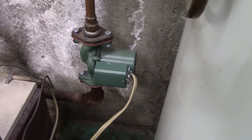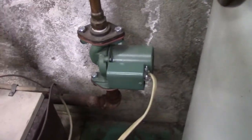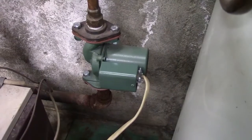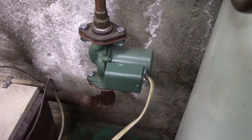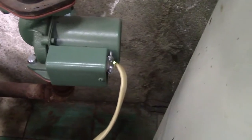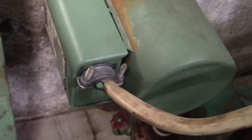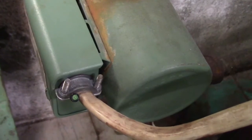Provided either of the zones are calling for heat and the wire didn't get cut by the clamp — which I wouldn't foresee happening — if it did, I think the wire would just act as a fuse itself and everything else will be fine. It's time to plug it in. Something turned on — looky there, we have a green light! This zone isn't calling for heat right now, so I'm going to leave it alone because I have other things to do with the boiler, and perhaps by then this will be calling for heat.